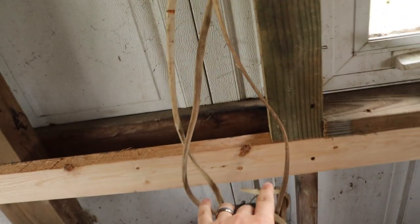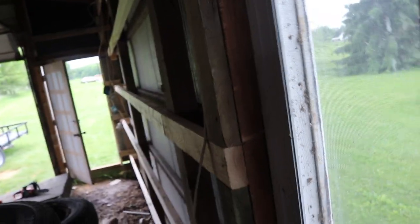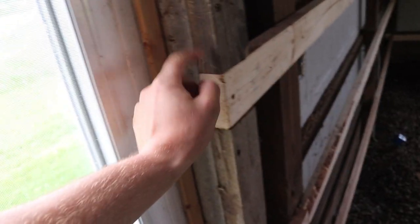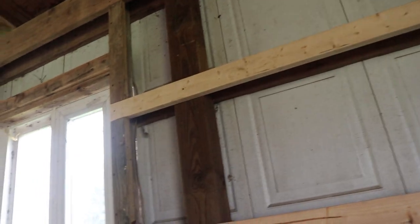I got the window all framed out. I'm not exactly sure how you'd normally do this, but the way I did it was I ran my 2x4s up to the framing for the window and then cut pieces to fit in between those gaps. That way there's a nice surface to tack into around the window, and all those gaps are going to be sealed — you won't have the tin up here with a big air gap going into the wall. I just boxed it in so that it would be flush all the way down.